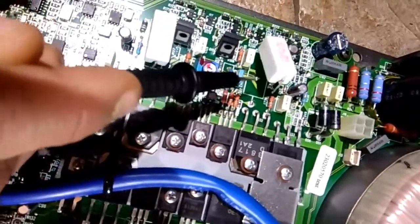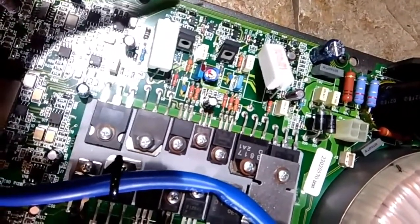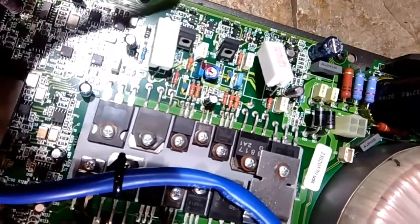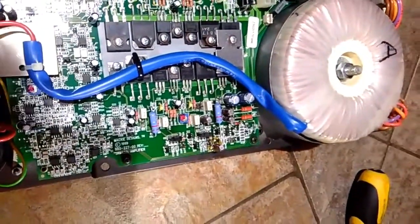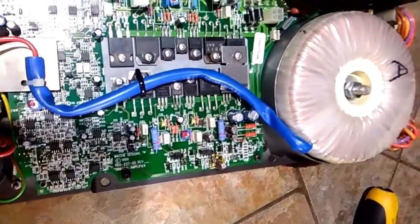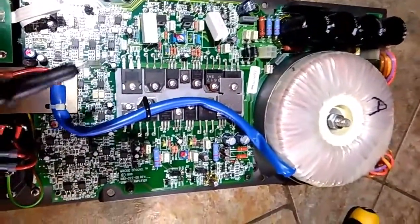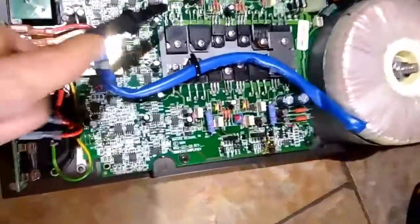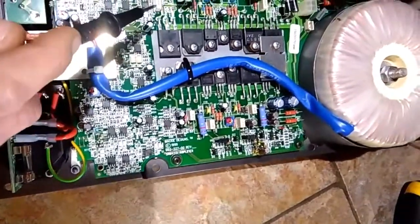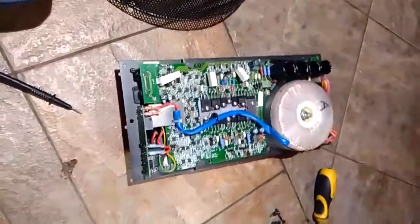And then all of a sudden, there's my problem — and hopefully it's my only problem. If you start suffering distortion with your SRM 450s, or even the 350s or 300s, that is a common fault apparently. They came off the solder. Hopefully that helped — now I've got to try and fix my other speakers. Cheers.